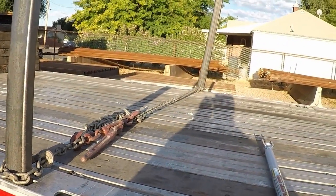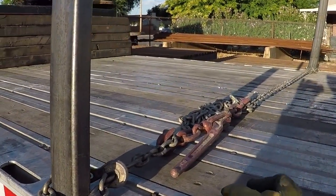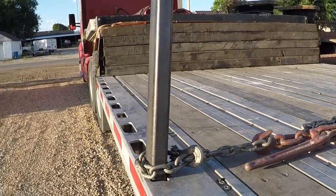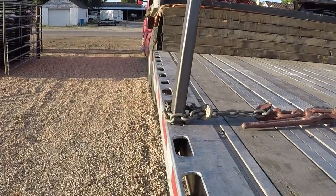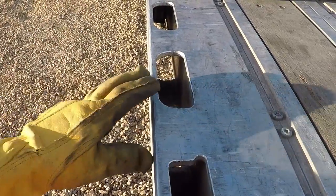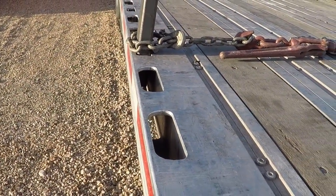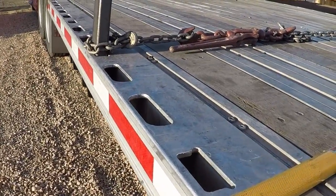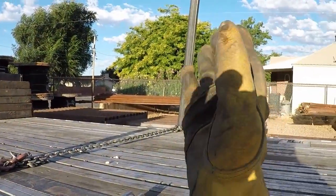What I wanted to show you is here's a better look at the pipe stakes and how I have them put together. Essentially you just have a chain run across the bottom holding the pipe stakes together, pulled to the center of your trailer. That way it doesn't push the pipe stake out when weight is on it — the pipe stake's not pushing out away from your trailer and bending your trailer rails. These Fontaine trailers are built really well as far as the outside railing system goes — it's one full piece attached to the deck, not just a single piece of aluminum that can pop welds.